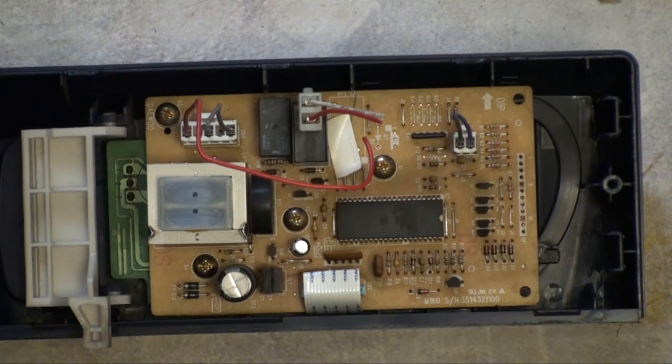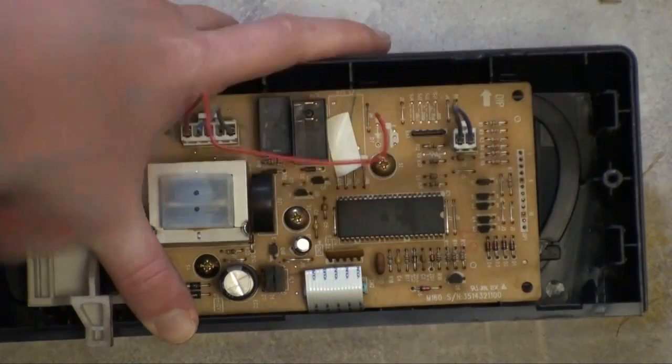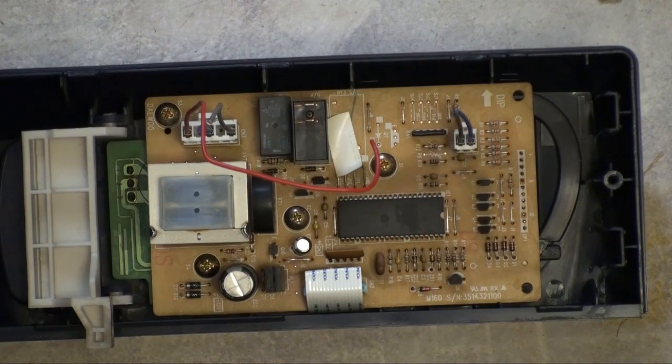This is the control circuit board. It was a kind of a cheap microwave, so consequently this is also looking kind of cheap. It does, however, have its own independent power supply. There is a little transformer and smoothing capacitor, stabilizer circuit, all integrated into one chip right there. The interesting bit is this right there — this is a relay that turns the microwave oven transformer on and off. The great thing is it has a 16-amp rating, so that is quite handy for some household projects, controlling lights or whatever.